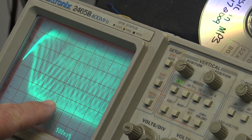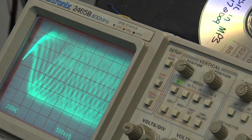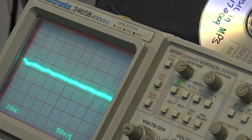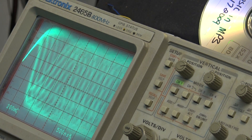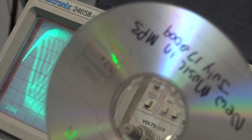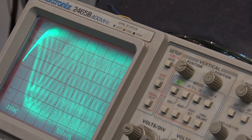Here's a different disc — as you can see, that first disc had quite a bit of fluctuation. Could be a bit of warpage. Here's the third disc; if I go back to disc number one, that's the one that tended to have a bit of jitter. Either the hole is not exactly in the center where they punched it, or the disc itself has picked up a slight warp. But that's a disc problem — the player itself, other than that, is fine.